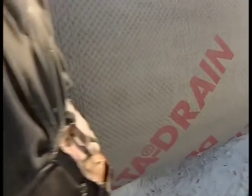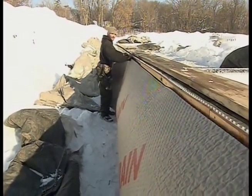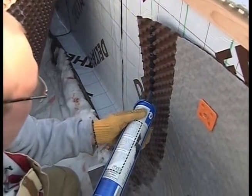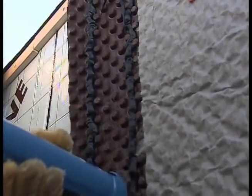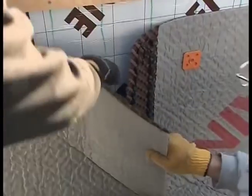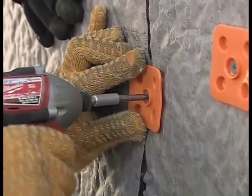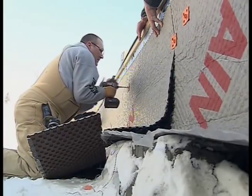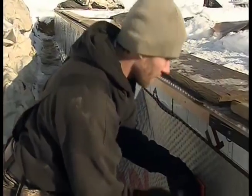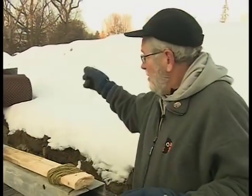The dimple wall takes all the hydrostatic pressure off the wall in terms of water. If any water gets behind the area up against the peel-and-stick material, it just slides down the back — it doesn't have that pressure to push it into the wall. Beyond that, it also has a fabric on the outside that keeps the soil away from the dimple wall. The dimple wall gets screwed right into the forms; we have those plastic tabs that run the length of the entire form, and it makes a really solid screwing surface so the dimple wall is held very tightly up against the wall.